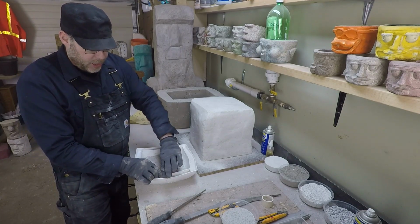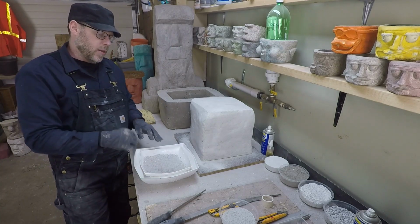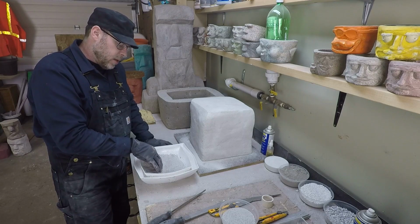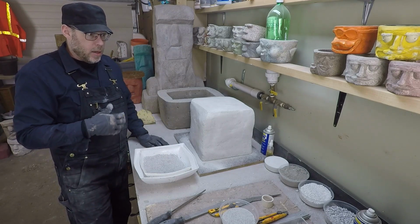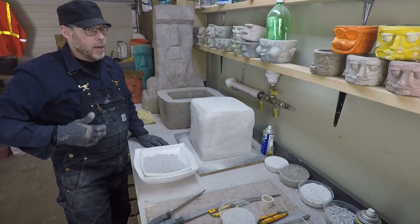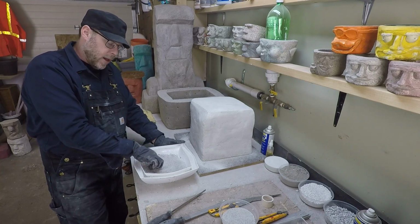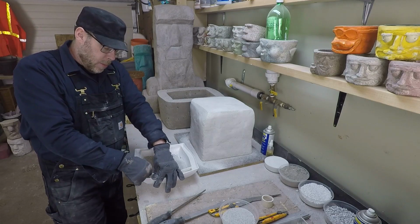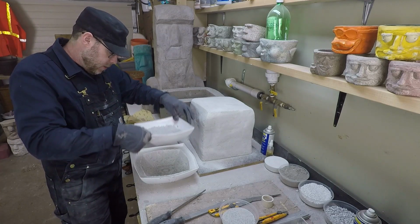Break the mold free at the edges. I have a hole in the middle of this, if you saw the first half of this video, and it allows some of the mortar mixture to flow into this interior bowl. And I do that so that we don't end up with as many air pockets trapped there. So there is a little plug of mortar right here I can feel, and that's going to have to break off in order to get this top bowl out. But it should, yeah, it's just connected by that little dot. So let's see how this one turned out.